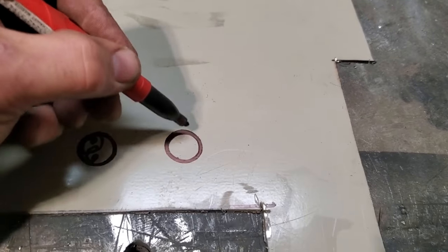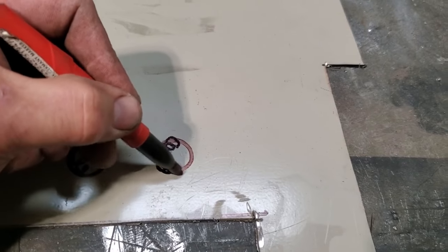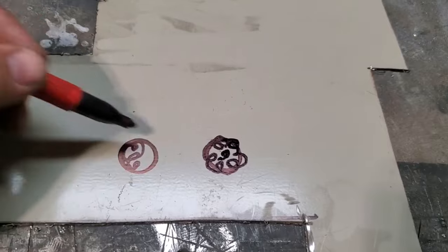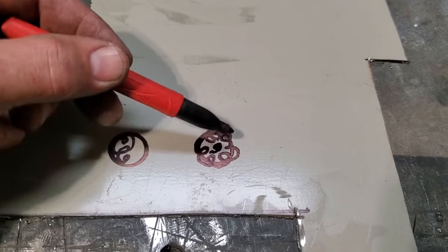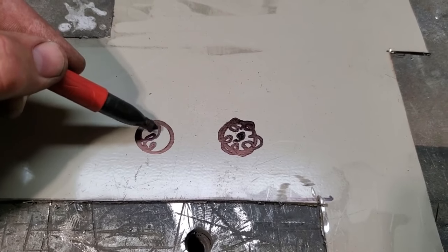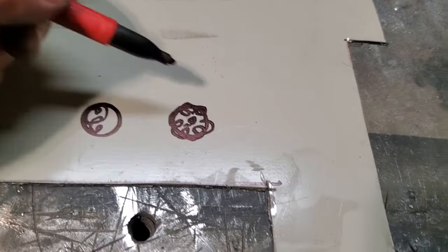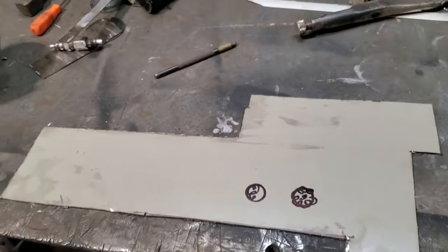How I've always welded my spot welds is I've always started out here on the side and welded around the outside like this. That's how I've always welded them. And I've always ended up with a low spot in the middle, which I don't mind, and I have to weld it up in the middle. That's two different ways fellas do it. Both ways work. I prefer this way because I've always got penetration here. With this one, I found that if you put too much weld in the middle, you're not getting the penetration out here because your heat is being blocked by the blob of weld you put here. So I just like doing it this way and working my way around the weld. Figured I'd point that out. A number of you have asked about spot welding, and that's how I do them.